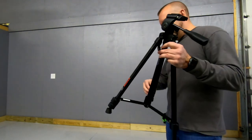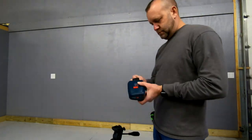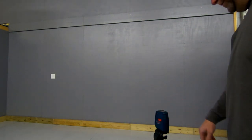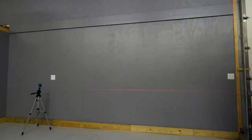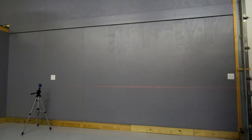I'm going to set up a self-leveling laser to help me get the ledger board set in the correct place. I've already measured and put a mark on the wall — I'll still use the level, but this will help make sure I'm starting off right. Every time I touch the laser it jumps a little, so I have to make minute adjustments and then check it to the mark. All I'm doing is cranking it up or down just a little bit at a time. Got it.